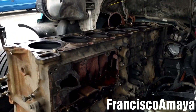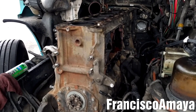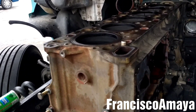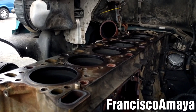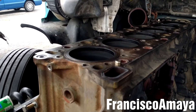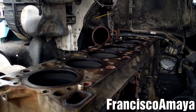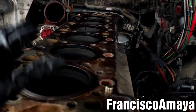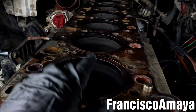The pistons are completely off. In this case I don't have the front end of the engine, which is going to be easier to show you. But you can also do it with all the other components in place, because that's the way you want to do the overhaul. You don't have to remove any of those if you are planning to do an overhaul on a DD15, DD13, or DD16. I'm going to start by removing cylinder number one.